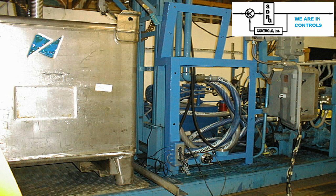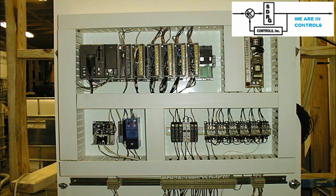The blending skids were basically a sum of many simple systems. Sometimes the difficulty was finding the root cause of a problem, which could be in the hydraulics, valves, wiring, controls, and so on. For example, what appeared as a simple problem with a hydraulically driven pump not delivering product to the mix could be hard to track down. The main hydraulic pump would turn a hydraulic motor which operated the ingredient feed pump, while electric motor-operated valves stopped flow from the feed tanks. In one case, it turned out to be a worn coupling in the main hydraulic pump — tough problems could be simple, low-cost fixes that were hard to find. Overall, the system was rugged and durable, and over time unreliable parts were replaced with good ones.